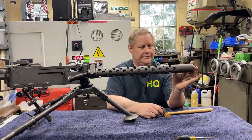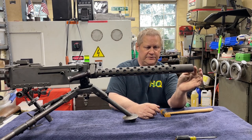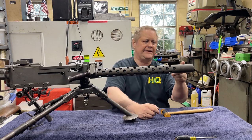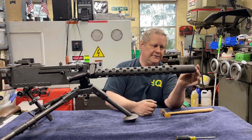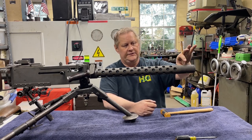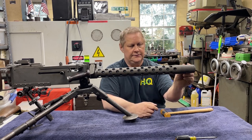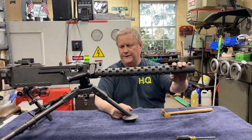Now this booster here is a cylinder closed on the end. It's a little bit bigger than bullet diameter. And the barrel doesn't come all the way up to the end. The barrel stops right about here somewhere. When the bullet goes through and comes out the end of the barrel, it partially plugs this hole, and this cylinder, because there is a collar back here that rides fairly closely onto the end of the barrel, it builds up pressure here. And that pressure helps push the barrel back to make the whole gun function.